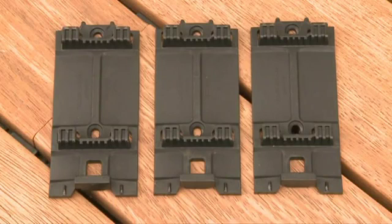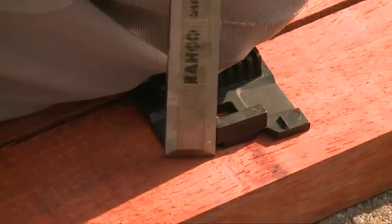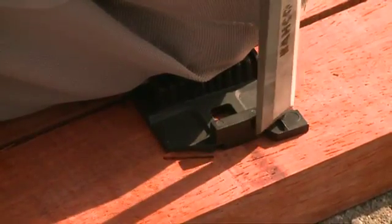We will now fix the Vetedy Softline clips. These clips are not plastic. They are made of a composite material which has a memory property. This allows it to follow the movement of the wood, which expands depending on the season. This composite material will not rust and does not mark the wood.